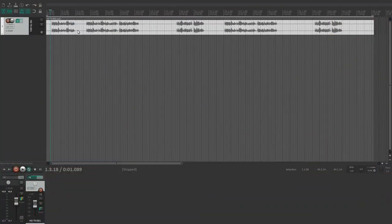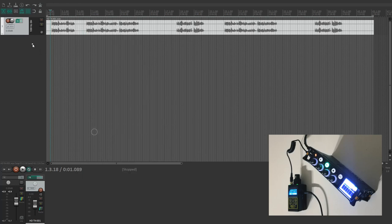I find it very important to test the quality and accuracy of the sound transmitted, received, and recorded. I recorded a voiceover through a large diaphragm condenser, put it into Reaper, digitally removed the entire noise floor, normalized to 0dB, and then played it out of a Sound Devices MixPre-6 on the same power source into the HDTX — both hardlined and transmitted. All limiters and roll-offs on the MixPre-6 and on the Connect system were disabled, so the transmitted or hardline sound should be as accurate as possible to the original.